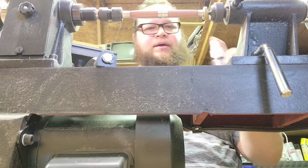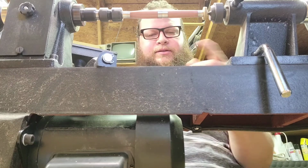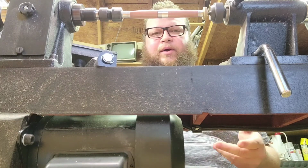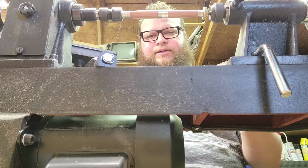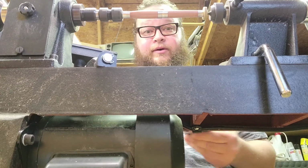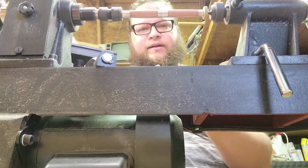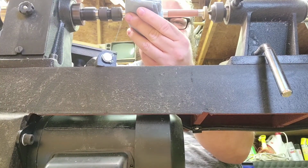I don't use the little plastic bits that go in between that you can use when you're doing CA glue finishes. The reason I don't use those, I have a lot of problems when you take it off. It leaves a bunch of CA glue around it, and then you have the issue with cleaning it off, and then you'll chip it on the ends. So I found doing it this way and then taking a razor knife and scoring it comes off much easier, and you don't have the problems that you have with the others.